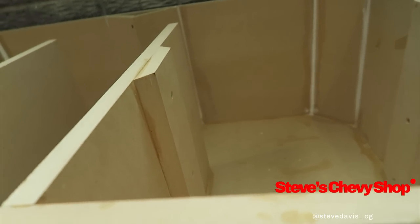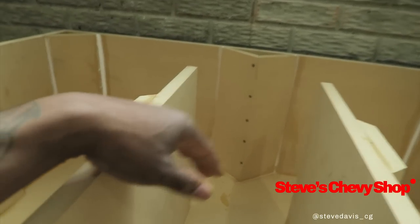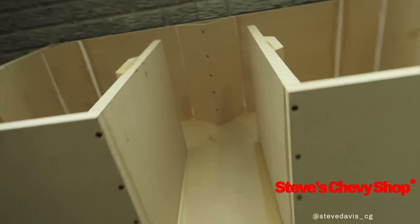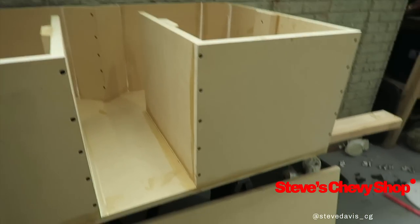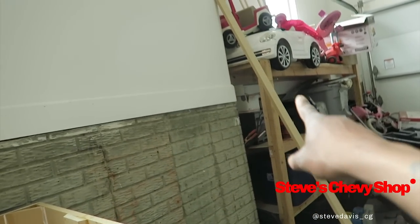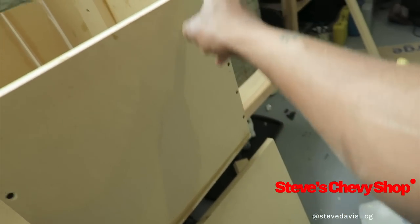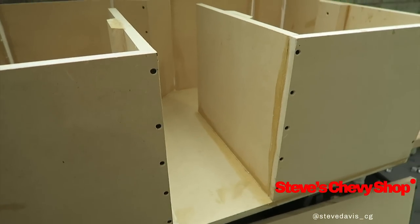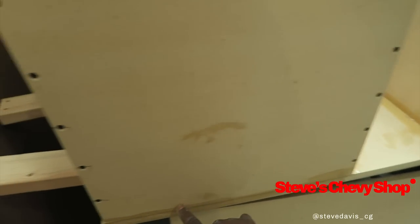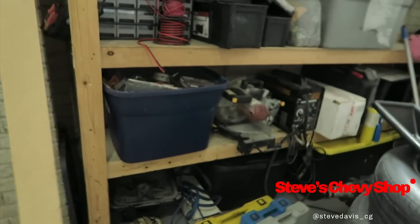This is my first time doing bracing like this — I put those directly in the middle, the inside thing with the 2x45s right there. For the cutouts I think it said 14.1 — I'm about to go check the sheet. What I like to do is put the top on, then you can get a piece of wood that's long, or a two-by-four, or use a straight edge, and go from the corner — you gotta put the top on because if you don't you're gonna be three-quarters off. Make a straight line, and in the middle is where your hole is gonna go. Once I cut the hole I put the screws back in and grind them down to where I want them. I use a Makita plunge router to cut the holes.